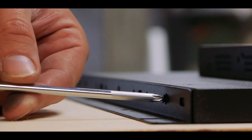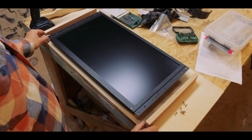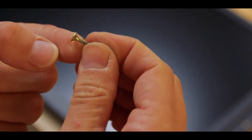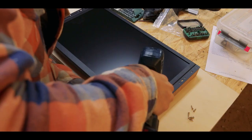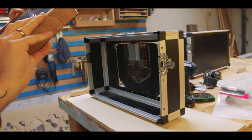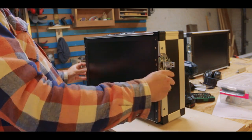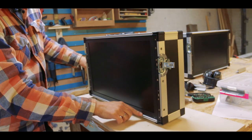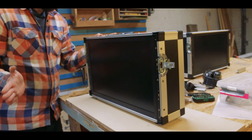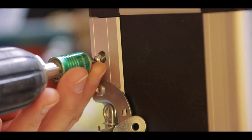Because these are screens and they will be living on top of a table quite often, it's now time to put the screen into the flight case. My two pieces of plywood go under the screens and get attached with small screws since they will be visible on the front. Make sure the screen is the right way up — you want the power connector facing down. The goal is to have the screens recessed just a little bit on the inside so that when the two boxes close, the screens don't actually hit each other. They slot straight into the plywood rail.